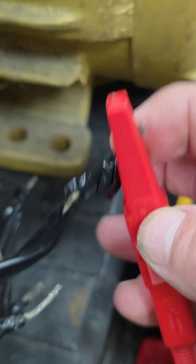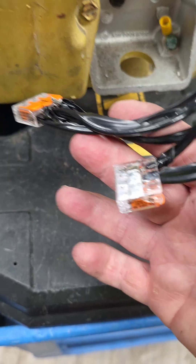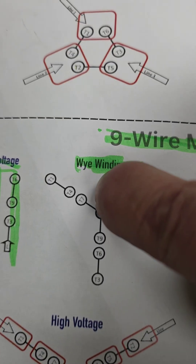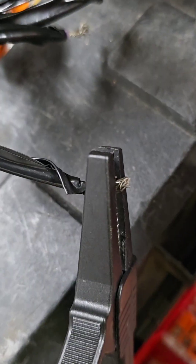The two tools you need are a blank piece of paper and a pen. Now we start the process of elimination: alligator clip on wire X, other alligator clip on other wire X — you're basically going to clip to every wire until you find the one that beeps. Then you're going to want to mark those two wires or pair them up in a WAGO. You can use WAGOs, wire nuts, or some kind of numbered label system — label them so you understand what's happening.